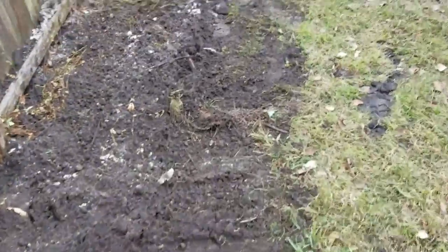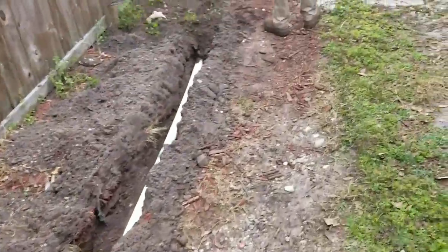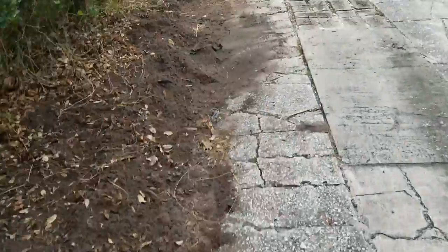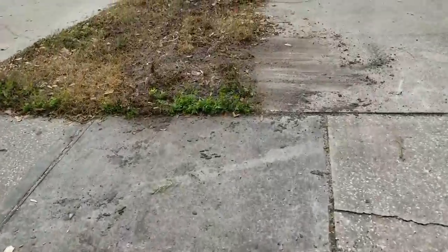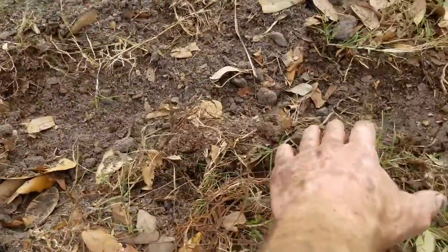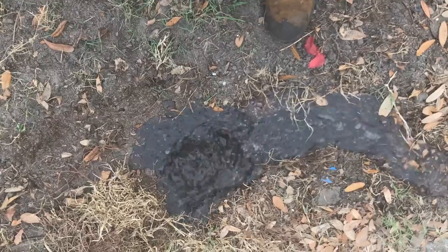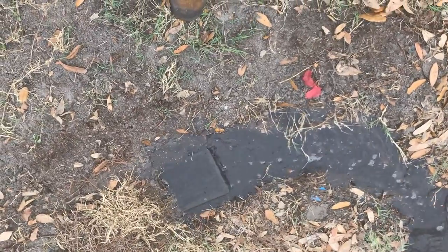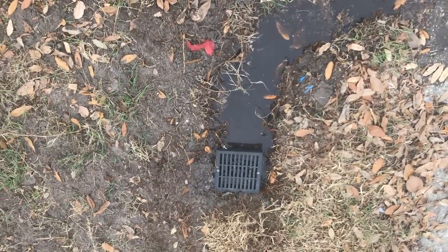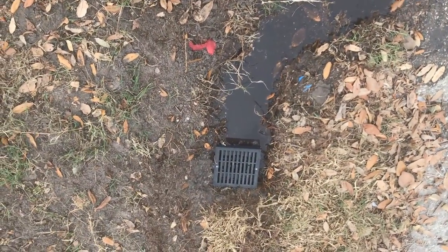These guys are backfilling - looking real good. It's a long trip down this hill. Simple to backfill: just use your rake, pull it back on the trench, leave it kind of high so it settles. Not yet - it's going to take a couple of cycles to get that water all the way up here to the basin. What we did was make a little trench to bring that water over to the driveway and let it get out onto the street. As it goes through another cycle we should see water come out here. See how they're pushing it all the way up that hill - comes out quick, doesn't it? Half-horsepower pump, pushing up 150 feet, 20 to 25-foot head, and that water easily came out here to the street. During a big rain this water is going to pour out of here.